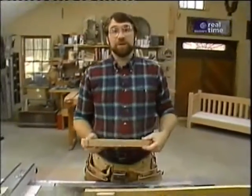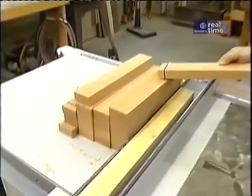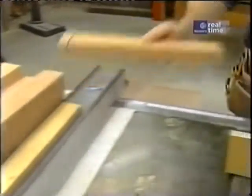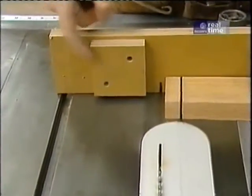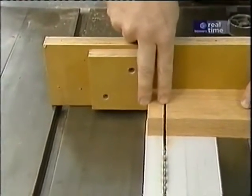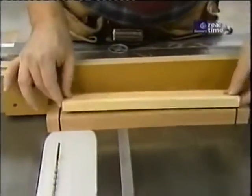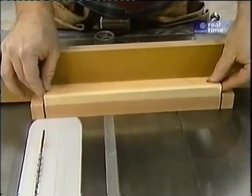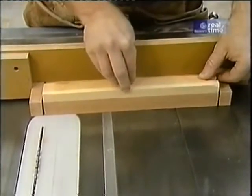Now I'm making the shoulder cuts on the slats — there are actually 20 of them in all. To do that I've turned back to my jig set up on my miter gauge, and all I've done is moved my stop block over to get this shorter tenon. To check the whole layout I used my gauge stick, and as you can see when I place it in line with the shoulder cuts they're even on both ends. So I'm all set.